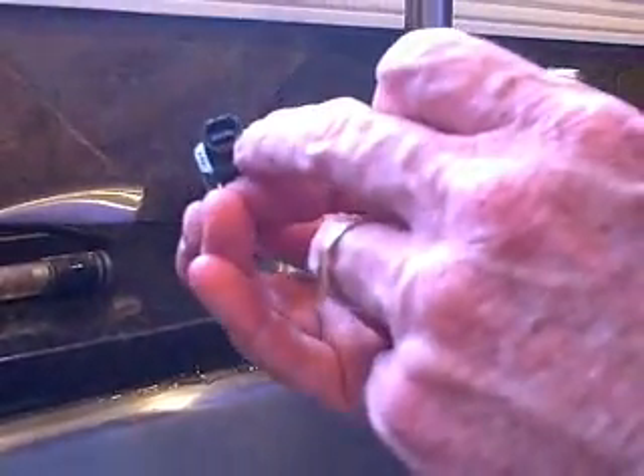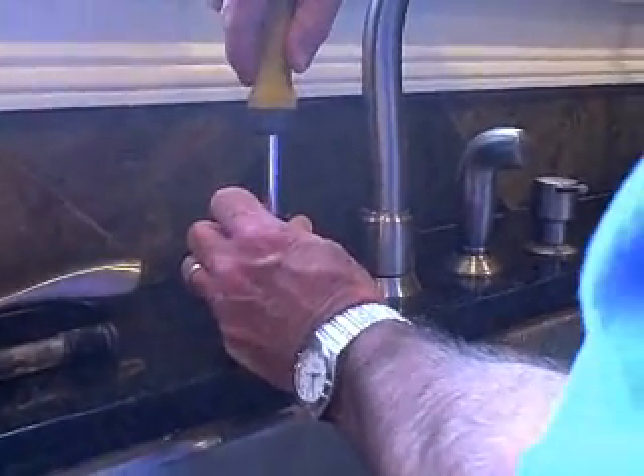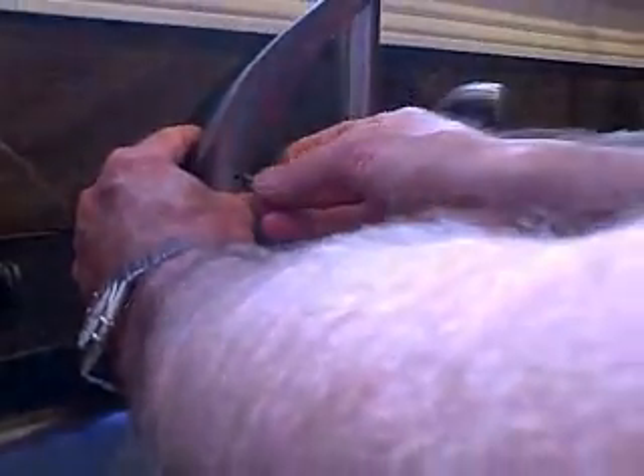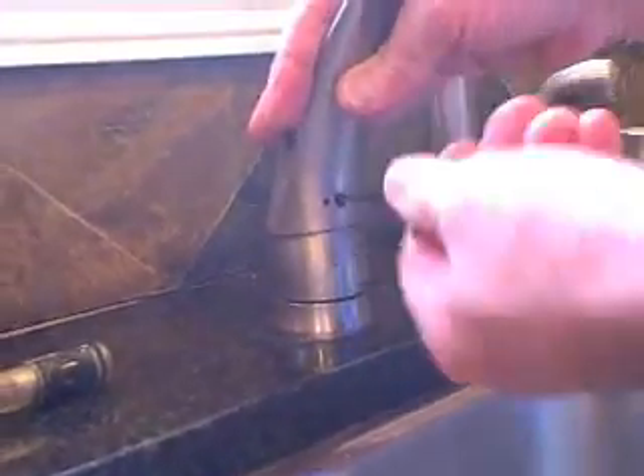This adapter has a little place on the bottom that fits onto the stem, and a screw that goes in the top — this little part swivels around. Make sure you put the screw in, then set this back on top and tighten it all up. You don't have to get it super tight; just hold it with your hands and snug it down pretty good, and it'll be fine. Put the little shroud back on. Now the last step is to install the handle back in, put the set screw back in and get it started.